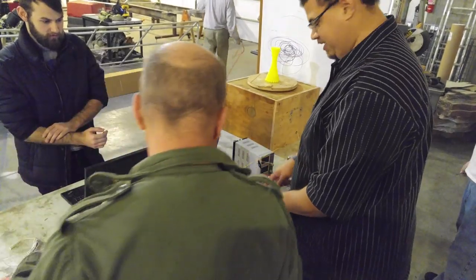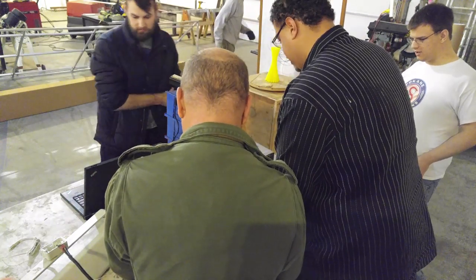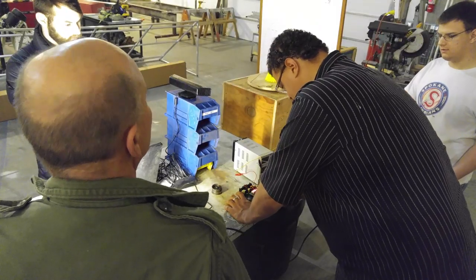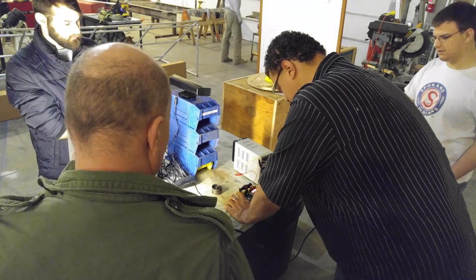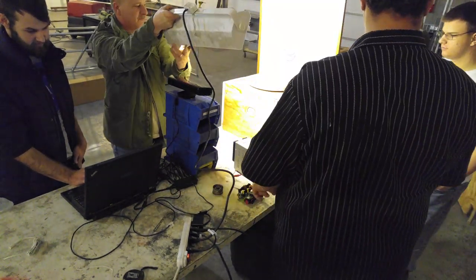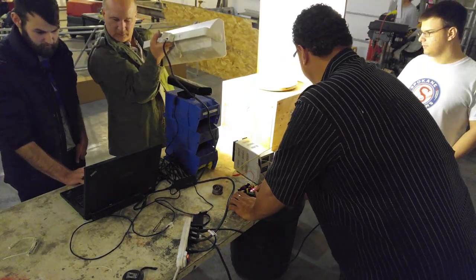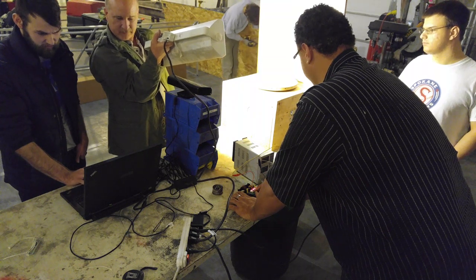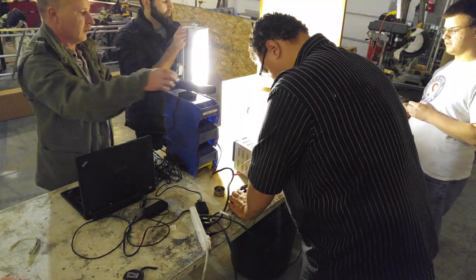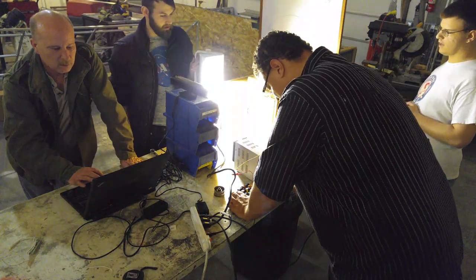We're going to try my device I made. This is up to 6 amps, 36 volts. Let's not do it at 24 volts. It's going to max out your current anyway. Yeah, you're right. So what voltage was this at? Let's go to 3. Should we limit the current or just leave it? Limit the current to like 4 amps. Oh! Look at that! Front of the car. It works! We are bouncing off the current limiter though. Do you want to drop the voltage or the current? Voltage, probably. Looks a lot smoother. Yeah, that all looks good. This is a 12 volt motor, correct? Yes. But you gotta get 6 amps. Yeah. And then it'll be really fast. I don't want that to fly off of there.